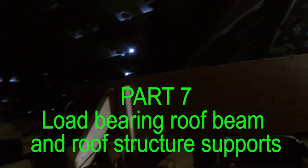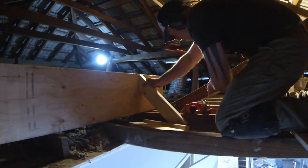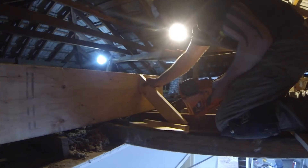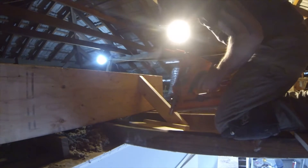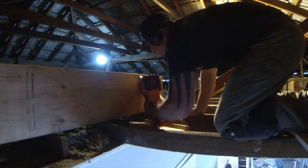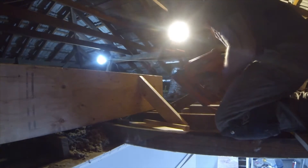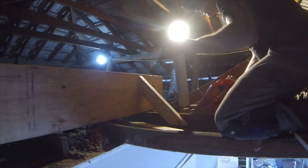Installing a soldier and a prop at each end to keep it from rocking and rolling either way, so it'll still free up the middle to come up to the height that we need. I want to get this brace as close to the top as possible — maybe about 10mm down from the top — making sure that we angle our nails so they have some opposing force. You can see there, that's not coming out. I'll get a soldier here.